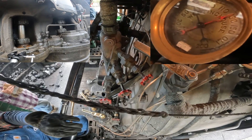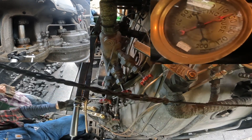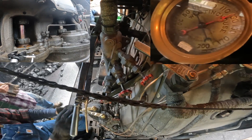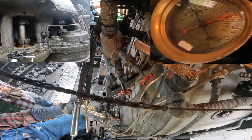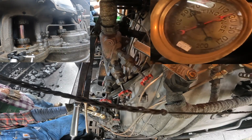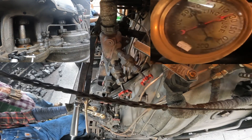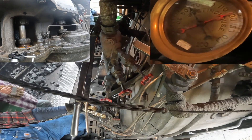You can also see that the air compressor occasionally will just cycle. They're always designed to cycle a little bit based on cold weather to make sure they don't freeze. We can see that Paul's got a good five-pound set or so on the train now, and the air compressor runs a couple times to catch the main reservoir back up as we've used some of the air.